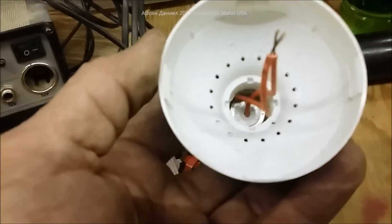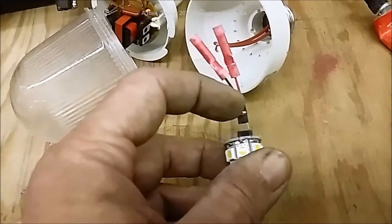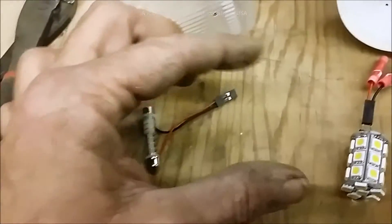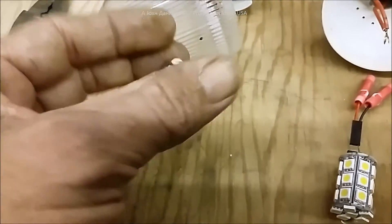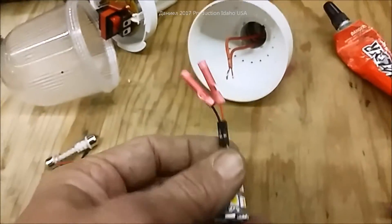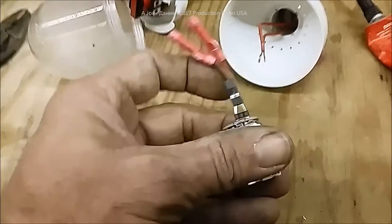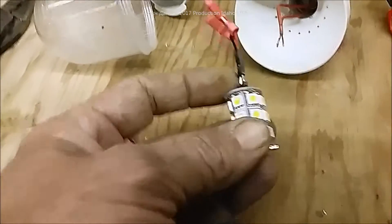What I've got here is a G4 bulb, and just by using one of these little connectors and a little welder glue to keep it from ever slipping off - you get these connectors, they come with the little light assemblies for square lights for RVs or overhead lights, and sometimes they send you four or five different ones. I've determined which side is hot and which is not. On these bulbs the outside wire is offset - the outside one is always the positive, always hot.